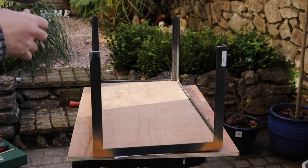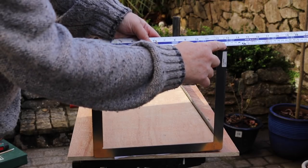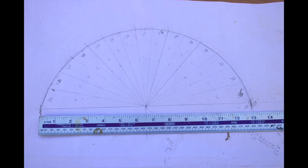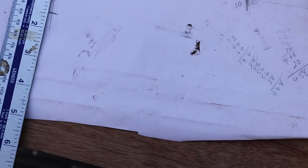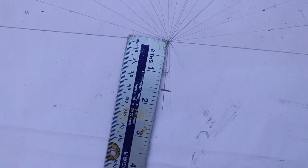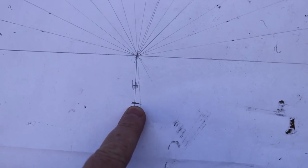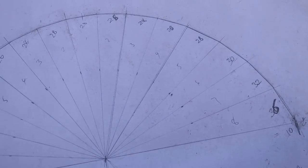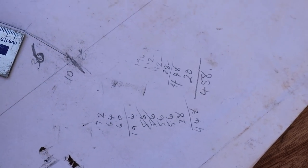Then I measured the width ready for the lid and transferred these measurements onto a piece of paper. From the center I came down one and a half inches — this is where I put the compass — because I didn't want a full half circle, I wanted it a little bit shallower. From that point I drew a half circle down to the line, which would be the bottom part of the lid, then divided that into 15 equal parts.